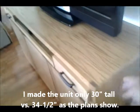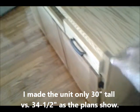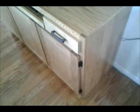I made this 18 inches deep, like the plan showed, and I'm going to make these side bases 16 inches. So I'll put a piece of trim here. I overlapped the trim by 1/8 inch. That's common. That is the same as our kitchen cabinets. So there'll be a base coming off here, and I'll have this covered, and this will all be butted up, so you won't see this